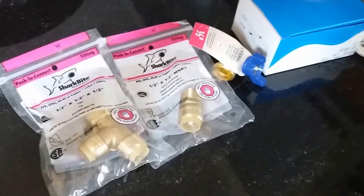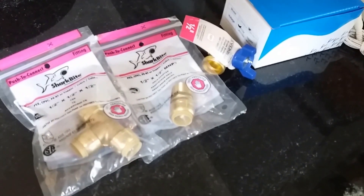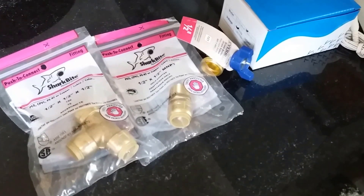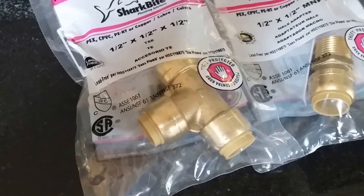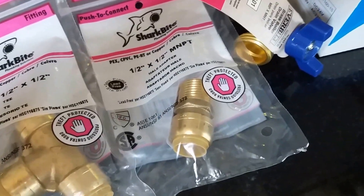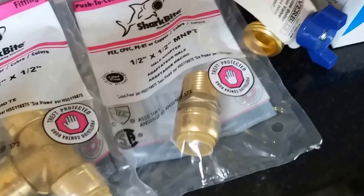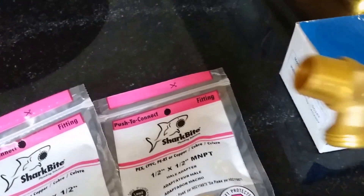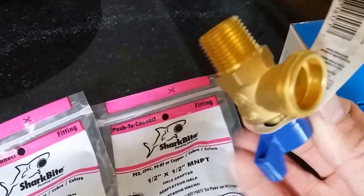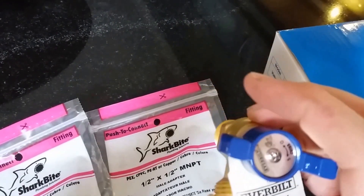The garden at the house has an irrigation system - just a single zone, doesn't spray a whole lot of volume. I wanted to hook that into my home automation, so I went over to Home Depot and grabbed a tee, a half-inch SharkBite connection that goes from PEX to half-inch NPT, and an NPT to GHT garden hose connection fitting with a valve on it.